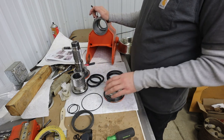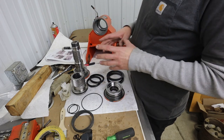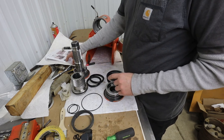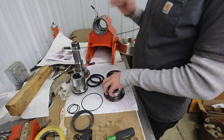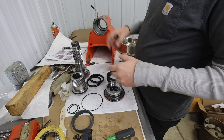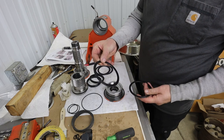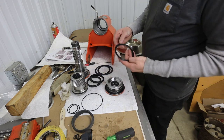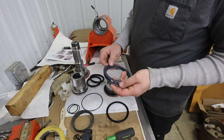This is an L20-8.2 model. And the Parker book on that repair is much more detailed than this one from JLG. Now this one is directly, the pictures and everything, directly from Parker. I will link down below the manual directly from Parker so you can see that. And if you wanted to order parts directly from Parker, you could. So it looks like this does just drop directly on there. And then you shoot the grease in the back. So I guess these are indeed out.